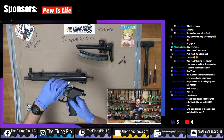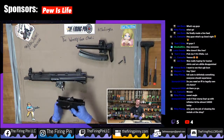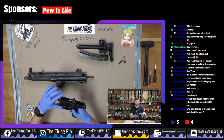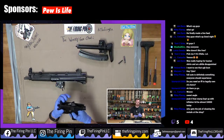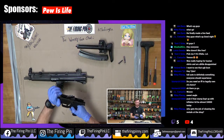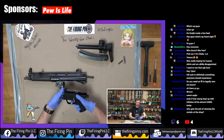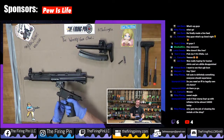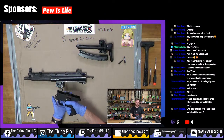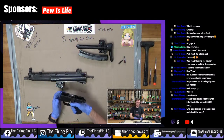You can actually see an XX on that hammer and on this bit here. This hammer is specifically set up with 2 notches, and this disconnector is not on semi-automatic variants. Well, most semi-automatic variants. When you press on this, you'll notice that the hammer just popped into a secondary notch. If I were to pull the trigger now, the hammer would fall like normal. And if I were to hold the trigger down, press the hammer back, and then press on that disconnector again, it'll reset to that position. Now if I let my finger out, pull the trigger again, it functions just like your average semi-automatic.